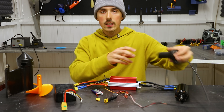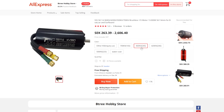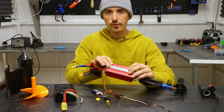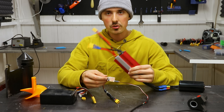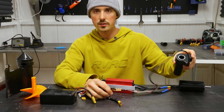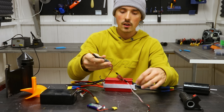When it comes to electronics, we have a twist throttle to adjust the speed of the motor. The brushless motor is the same motor we used on the electric surfboard, but this one is 360 kV so it's a bit slower, which means we can run a larger propeller. That's connected to a Flier 400-amp speed controller, and the speed controller is connected to a modified servo tester together with the twist throttle. I'll link a video in the description that shows you how to modify a servo tester for just a dollar to use a twist throttle with a brushless motor and ESC setup. There is also a BEC to take the 7 volts from this battery down to 5 volts for the servo tester.